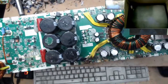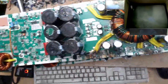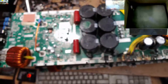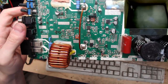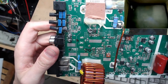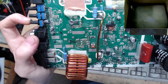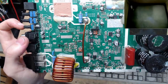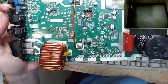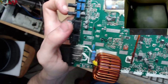We've got all the power supply caps. The transformer looks all right. Needs a power supply rebuild, obviously. All the rectifiers are there, although they're bent, but that's fine. The MCU is present as well. Needs some 072s in the preamp, and we also need the 712 on this one as well. This one needs lots and lots of chips replacing. Needs almost all the diodes replacing on the output here as well.